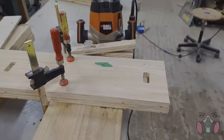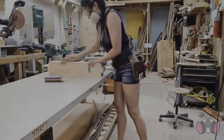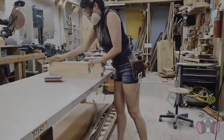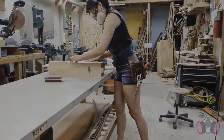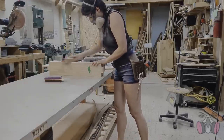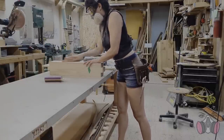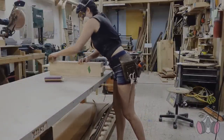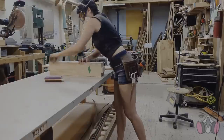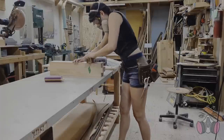Then I used a large top part that I just cut as a template for the last piece. Before gluing, I sanded down all the pieces first. I alternated between doing it by hand and using a sander, and the way I usually decide it's smooth enough is when I can run my hand along the edge and not get a splinter — which is not recommended, I don't know why that's my go-to. I also used the sander to round off the edges just a little bit. I didn't want to use the router because that would be too much, and I didn't think the fully rounded edge would work for this piece and the space where it needed to go.